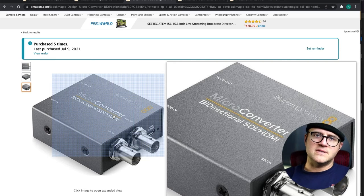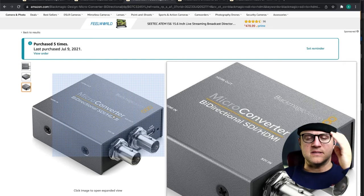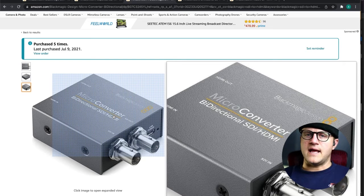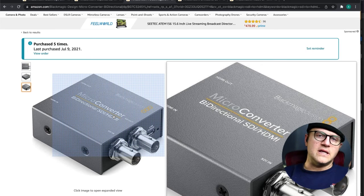And they do have the same signal, guys, and there's virtually no latency, especially between the daisy chained versions, because the signal is immediately passed along to the next box. There isn't any sort of conversion going on at the SDI to SDI out. So SDI in to SDI out isn't going to give you any latency.